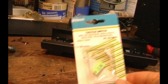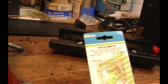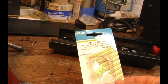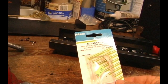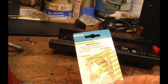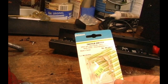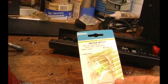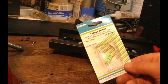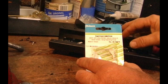It was two switches in a package. It's called the tactile switch — single pole, single throw SPST, off and on. Six by six millimeters and 3.8 millimeters high. 50 milliamps, 12 volts DC, 100 GF operating force. So they're very standard and used in everything — washing machines, television boards. You can find them everywhere.